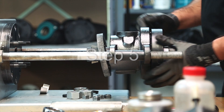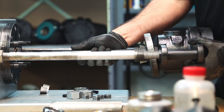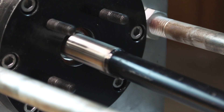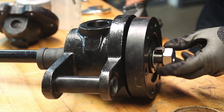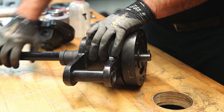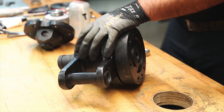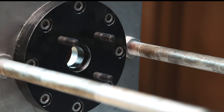Step 5: The horizontal siphon pipe will be removed with the rotary joint assembly. The siphon vertical leg will pivot to an upward position in line with the horizontal pipe as the rotary joint is moved away from the roll. Remove the retention nut and the multi-tab lock washer from the horizontal pipe and slide the siphon assembly out of the retention plate. Set the horizontal pipe aside for reuse. Remove and discard the metal gasket from the journal flange.